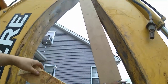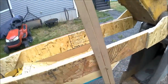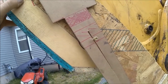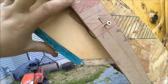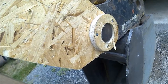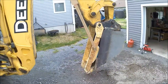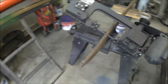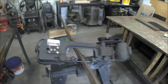You can see the cylinder moves back and forth as it extends — a pretty decent range, I'm happy with that. All the way to the top, I'm not pulling it back completely, but about three-quarters of an inch of rod sticks out inside. I made it so it doesn't hit the sides. I'll need to make a bushing and a new pin about an inch longer. Now I'm cutting the seven-eighth by four-inch metal pieces to 38 inches long.